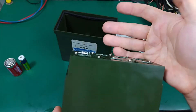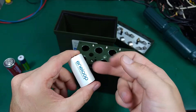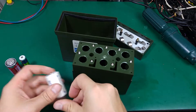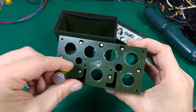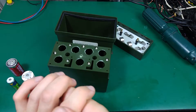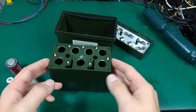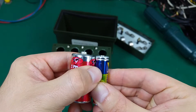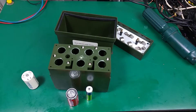I think that's quite important information if you would like to use this adapter, because these batteries are very commonly available. In that case you have to drill the hole a little bit larger, just enough to fit your battery and make a good contact. Thank you very much for watching. I hope this video saves you some time, because I really spent a lot of time before I opened everything and realized the hole was too small — the positive terminal length was the problem. See you next time, bye bye.